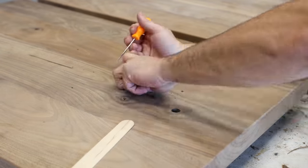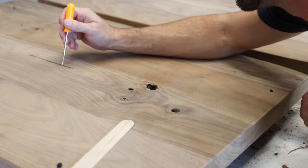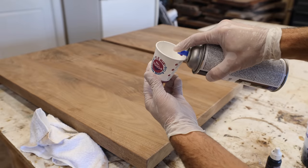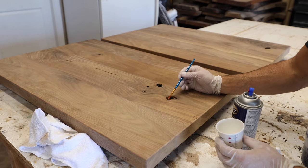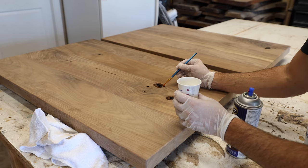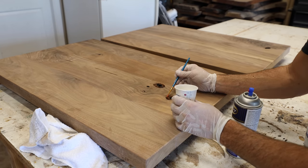Being sponsored by Superclear really gives me the opportunity to utilize their products in a bunch of various different ways. And in this case, I was going to use it for the side panels to seal up and close up all of the holes and inclusions that were on the outside. A little tip for you is I like to use any sort of spray lacquer, spray it into a cup and use a brush to actually put on the wood to prevent any dieback from the pigment that I'm gonna put in the epoxy, which in this case will be black.